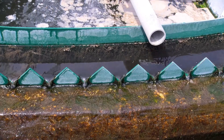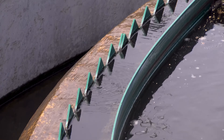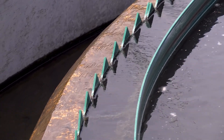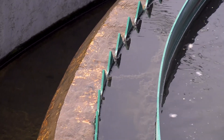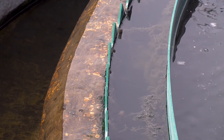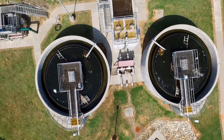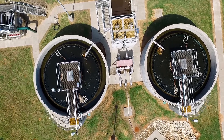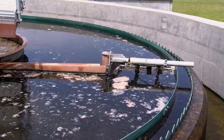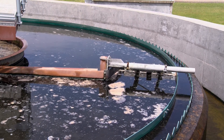As you can see you have excellent water clarity leaving this clarifier. It is also very common to have some algae growth both on the weirs and between your fixed weir and your v-notched weir. This is common because good clean water mixed with sunlight promotes the growth of algae. This is a maintenance issue and periodically you will need to go in and remove the algae.